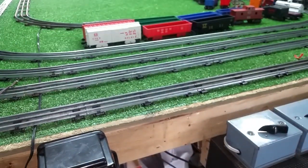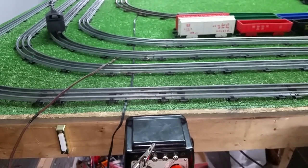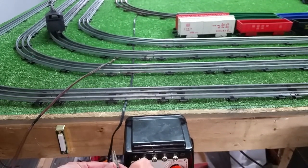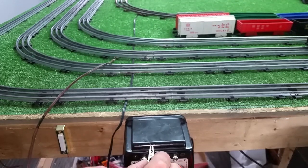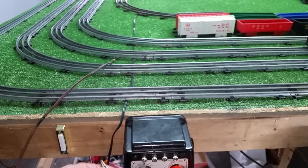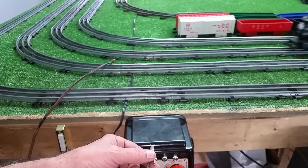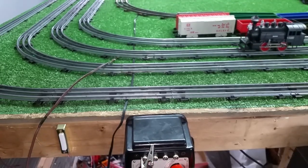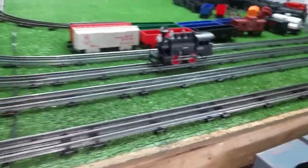And as you see, now the interesting thing about this is if I reverse the wires, I also reverse the direction. So it's a really simple way to get around, and like I said, it's an expedient. I can just add the diode directly to the motor, and it will be a standard locomotive — it will run on AC.